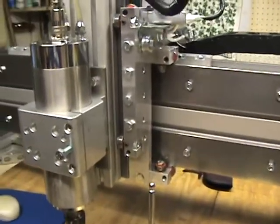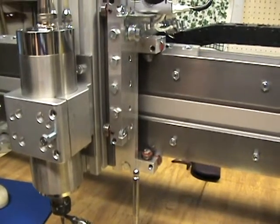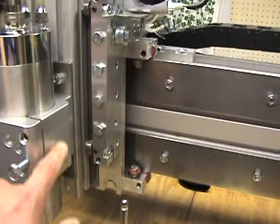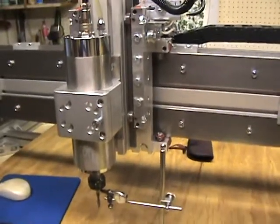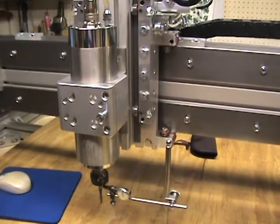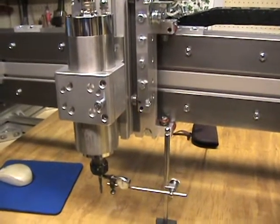So I just undid my bolts on this plate that I made up and then used a brass hammer and tapped it until I got it aligned. Now I'm within a thousandth vertically, up and down travel.